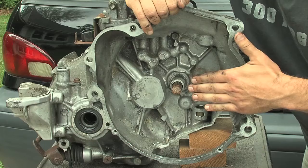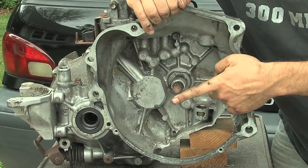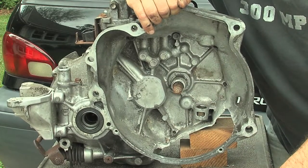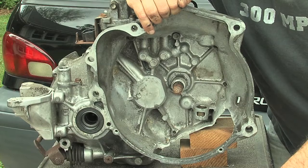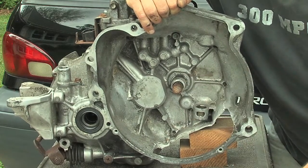In the engine version of the vehicle, this shaft would have come out further and been supported by the flywheel. So one thing we need to make sure of with the coupler is that the other end connects solidly onto the electric motor so that this shaft is properly supported.